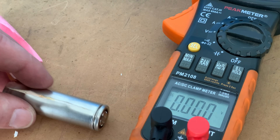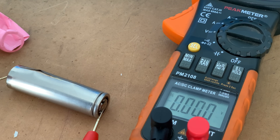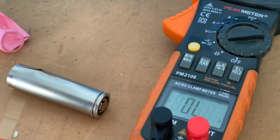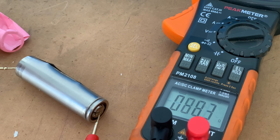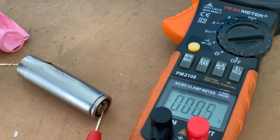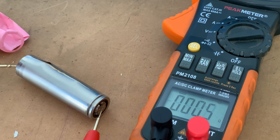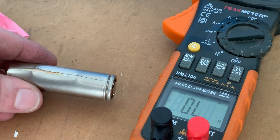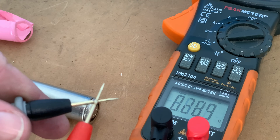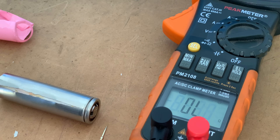We'll just have a look here, have a poke around this cell a little bit. So as you can see there's zero voltage there, there's nothing at all. I'm going to go continuity. That's odd - we've got continuity, which means that CID hasn't failed. That's even more puzzling. But it seems to me that the common response within the comment section is manufacturing fault. And that could be a seam. So that's saying the continuity is there. I don't even have one with a known blown CID.